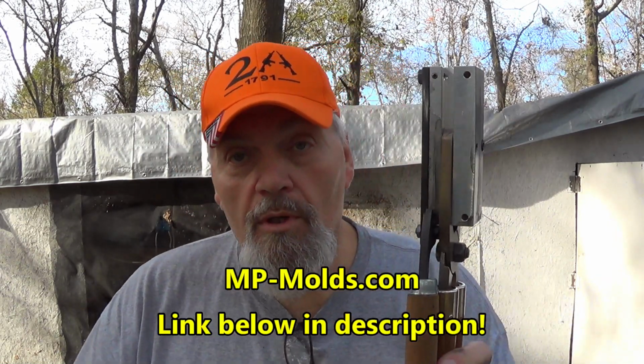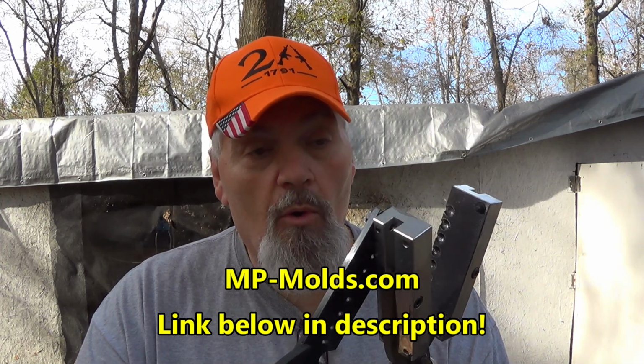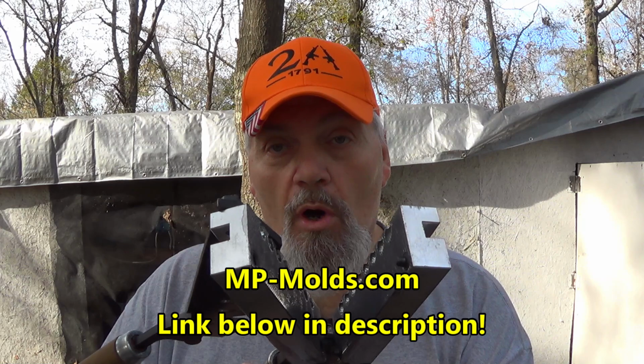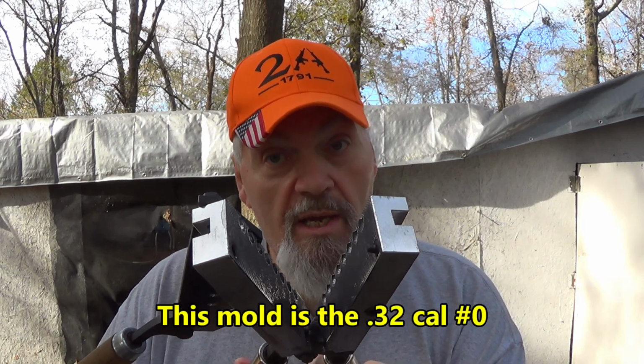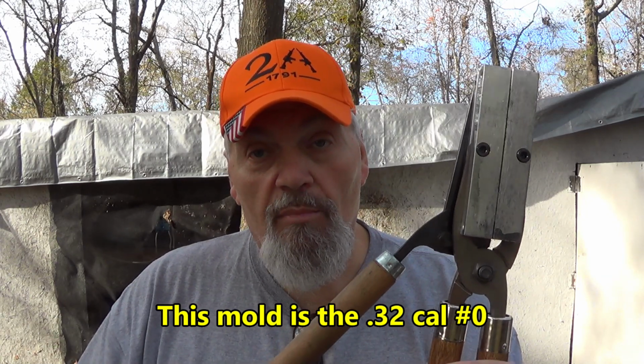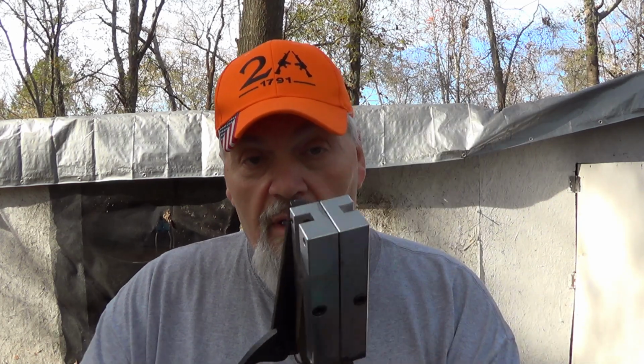MP Buckshot Mold, still testing this one. A subscriber helped me buy this mold. I had never heard of them. It is a Lee copy. See, it only has the top row on here that it pours 8 pellets at a time. But it pours 8 pellets at a time, cuts the sprue off, and these pellets are ready to go into the tumbler right after you dry them. Very, very nice. Yeah, only 8 at a time. I've made thousands with it. I love this mold. I do.